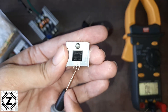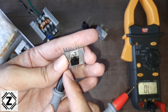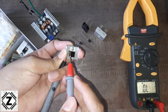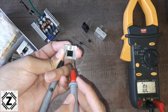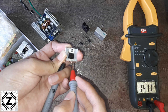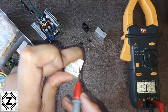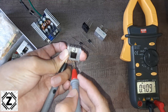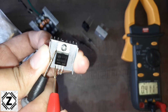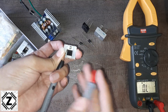The middle leg is the cathode. You can connect your multimeter there, or the entire heat sink body is also the cathode, so you can put your probe on it. With the negative probe on the body, let's test the first diode — it says 0.4 volts. It's going to waste around half a volt and convert that to heat, which will be taken away by the heat sink. The second diode also reads 0.4 volts. The middle pin is the common, so it will simply show 0 on the multimeter.